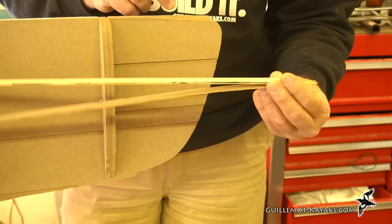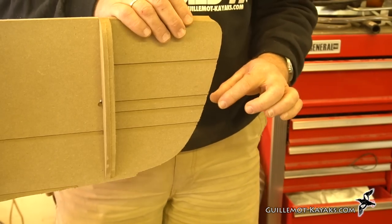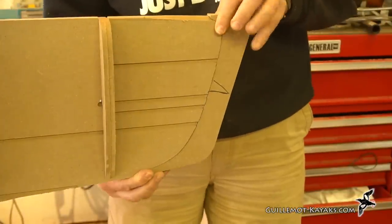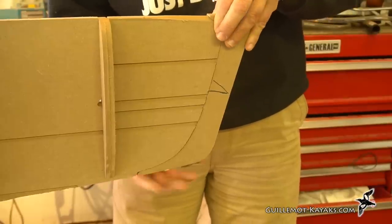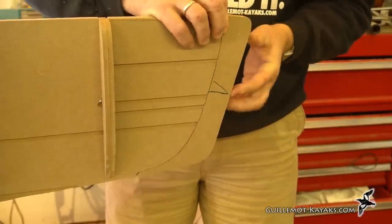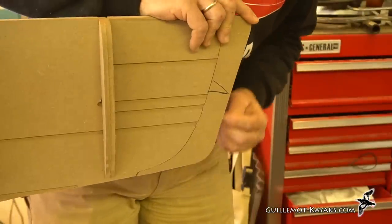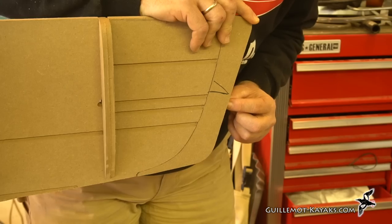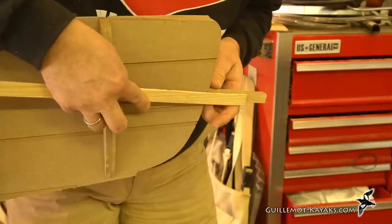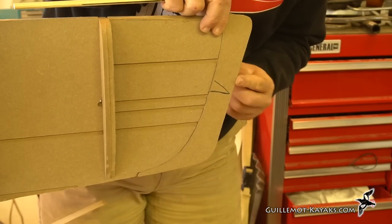The inner stem is a piece of wood that's shaped to fit that gap. And so here I have a pattern. This fits right onto the end of the stem, precise match between this curve and that curve. And so this is a pattern for my inner stem. And if you look at this, this leading edge here is where it comes to a perfect point. So again, my two strips coming together here will reach out and they end up somewhere out here. That's this point right here.